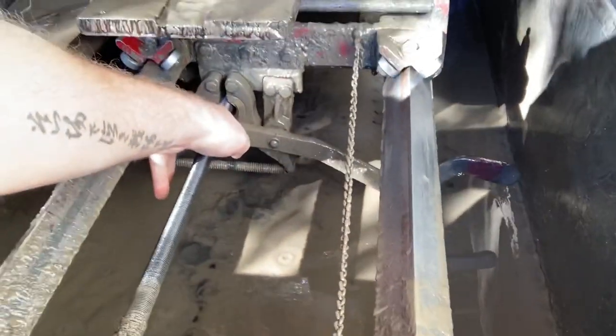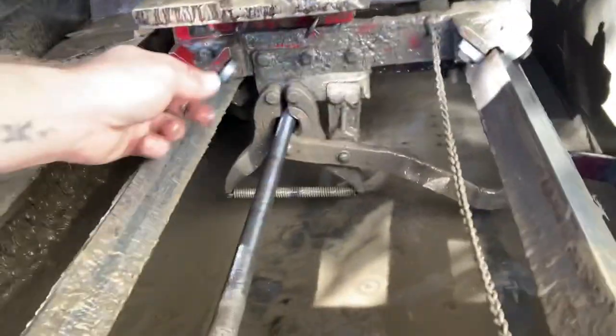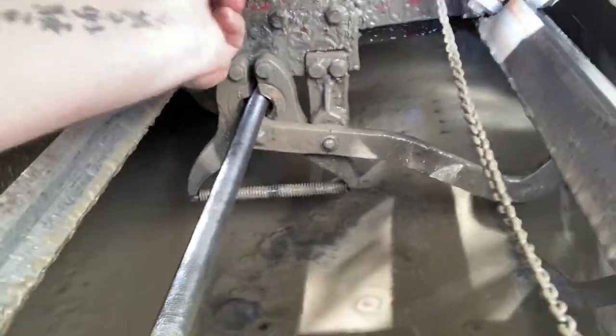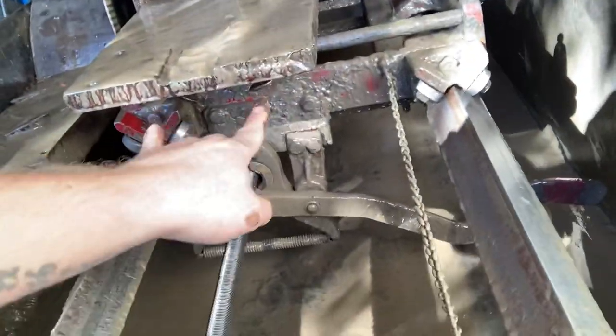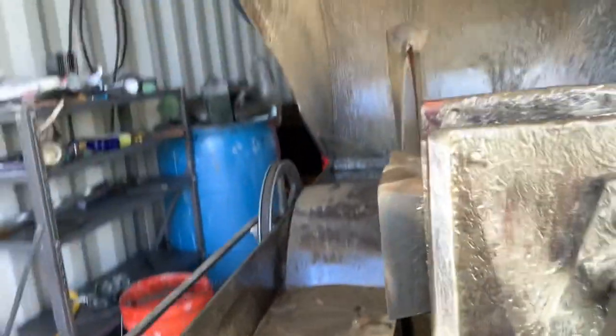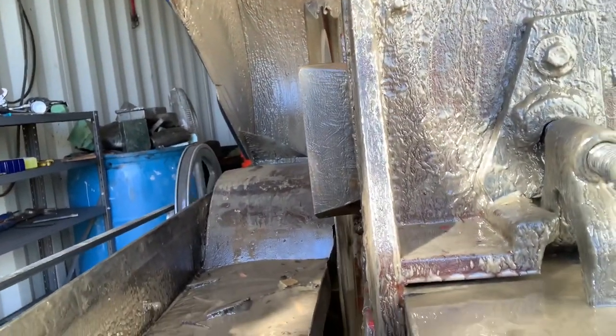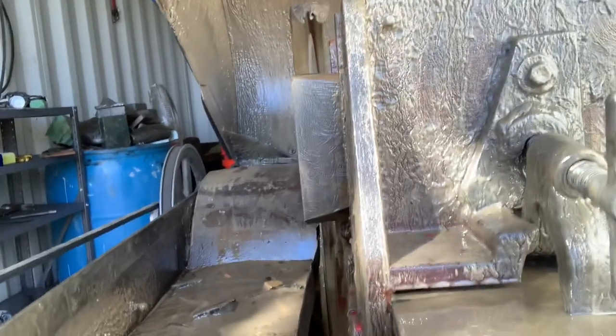All right, so that releases the carriage from the feed screw. And also I'm going to release these thumb screws down here. I don't know if you guys can see without me getting my phone in the oil. But that makes it so it's pinned to the bar the carriage is on. And now I'm going to be really careful not to bump the on switch. And you can see very straight and smooth cut. And if I give the blade some travel, you'll see that my saw blade doesn't dance too much. Because if it's moving back and forth like this, then you know your saw blade's not flat. And that'll show up as soon as you try to cut anything.